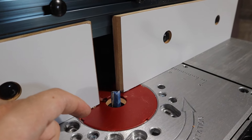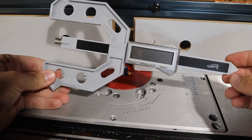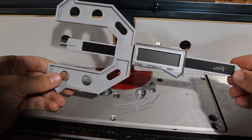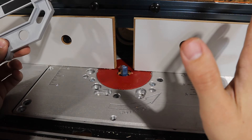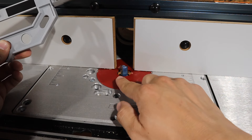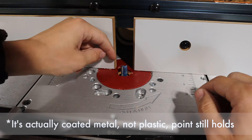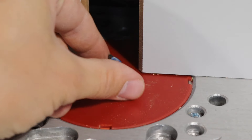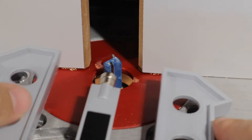You're going to do that to both sides. When you want to set the depth on your fence, I have this really handy depth gauge — I'll put a link in the description. This thing is super awesome for trying to set the depth on the router table and fence. On this one, I want to go a half inch deep by a half inch tall on my tongue because I've got a half inch groove — basically a half inch all the way around. I want to make sure this fence is set at a half inch deep from the furthest point out. You want to make sure you're measuring from the furthest out blade portion because that is the extent to which it's going to be cutting.